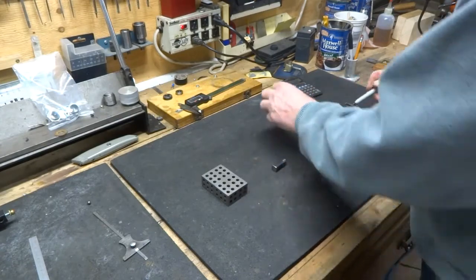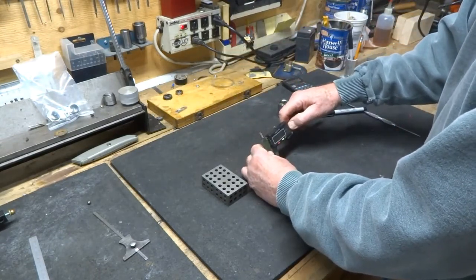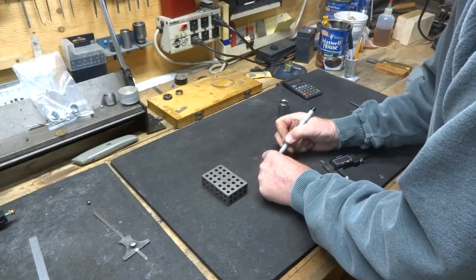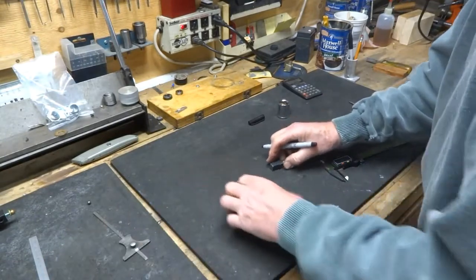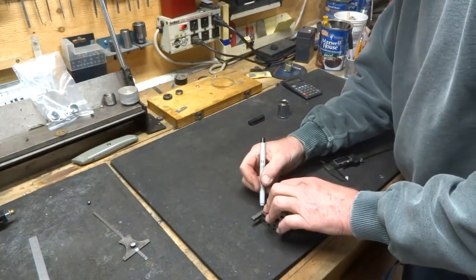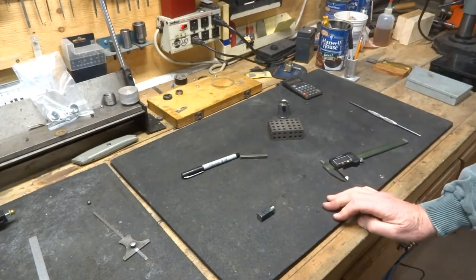We've got a little black line there, and you'll find that 3/16 of an inch back from that line, which would be right about there, not too fussy as long as we're fairly close here, right about there is where we want to put the ball bearing in. And in the middle, of course, there's a 1/2 inch piece of stock, and here's a 1/4 inch piece of key stock, and we'll just draw another line there. Where those two lines cross, that's where we're going to drill our 1/4 inch hole for our 1/4 inch bearing.